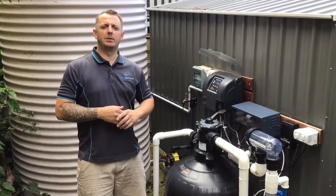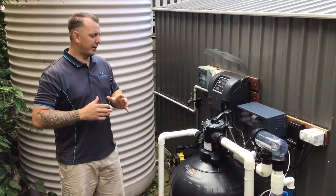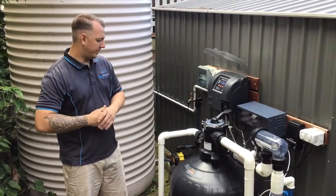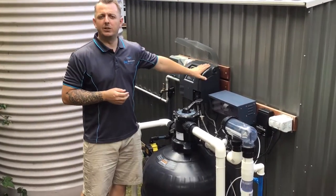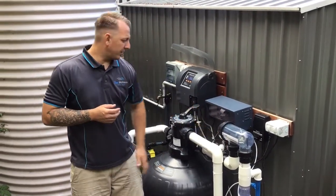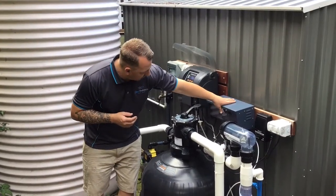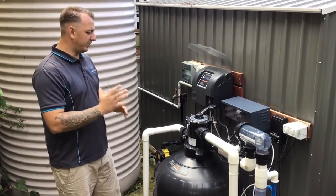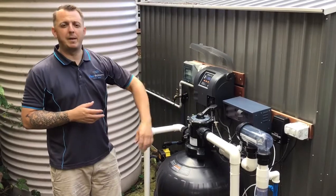Hi, I'm Tim from Pool Builders Pool Shop, and today we're here at Galimba at an Environ Pool. What I'm basically going to run through with you guys is just a sanitation system that we have set up for this pool here. We are running an Astral EQ chlorinator to give us our chlorine production as well as control our pH on our acid doser. We've also brought on our Ozone Swim from Natronics using the Dead Sea minerals as well. I want to give you guys a basic run through of how it starts from the skimmer box and works its way back into your pool.